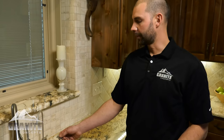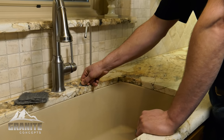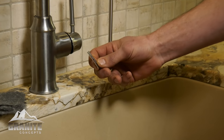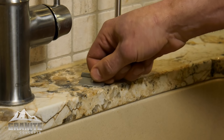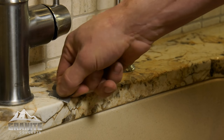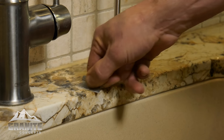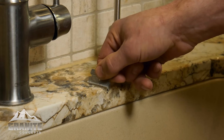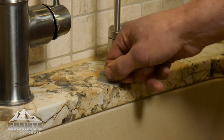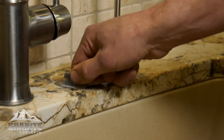In this area we have hard water deposits and they can create issues in our sink area and faucet area. I'd like to show you a way to take care of these stubborn hard water deposits. It takes a little bit of elbow grease, a straight razor, and some 4-0 steel wool. I'm just going to take the razor blade nice and flat on the surface and scrape the stone. As you can see, the hard water deposits are scraping right off. You can tell when you start to get hard water deposits because the stone starts to get dull looking — it doesn't have that shine, and no matter how much you wipe it with a cloth it doesn't get shiny.